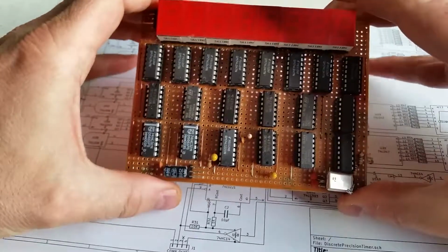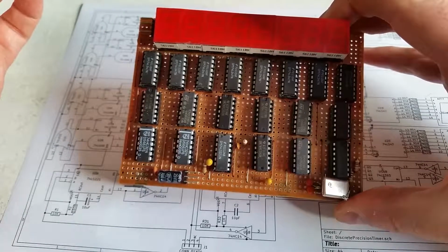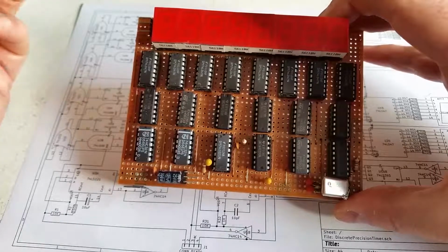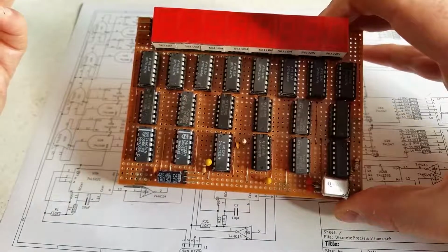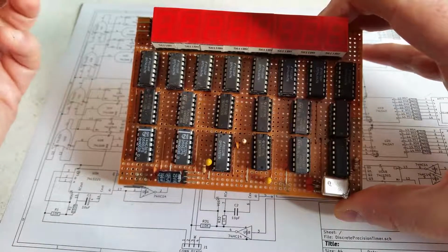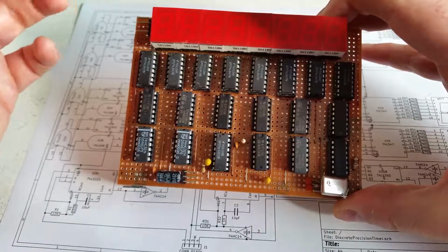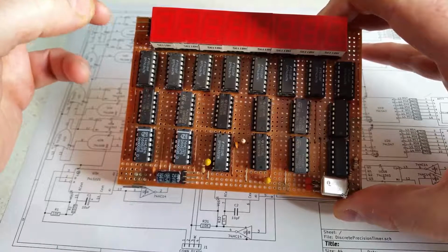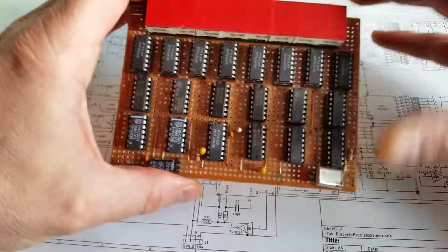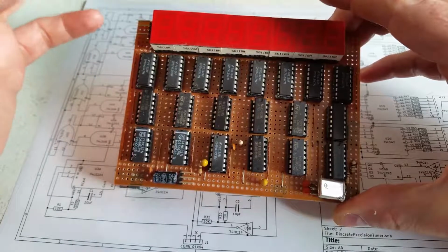I definitely want to try doing this in a microcontroller as well. That'll have certain advantages in that it'll take very little electronics, it's all programming, but the disadvantages are things which happen in microcontrollers, like instruction cycle times, interrupts occurring, and the fact that you are already dividing a counter down to be the instruction cycle, so the instructions are quite large in comparison to the amount of time you're trying to actually time. So it'd be interesting to see how that would compare.